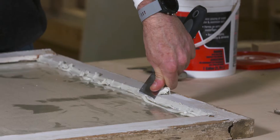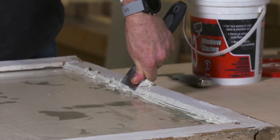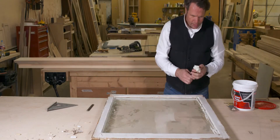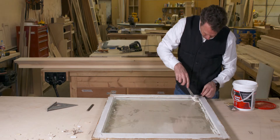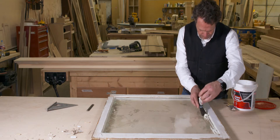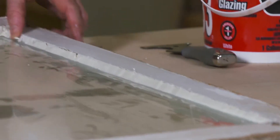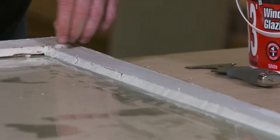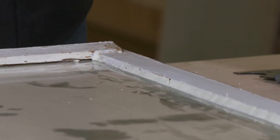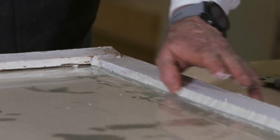I'm going to come in here at an even steady pressure, pitch the putty knife, and slowly draw it along the edge of the window. All that excess picks up very easily. Now I can come along with my finger wherever it's rough. Here's some old glazing that was actually still in good condition, so we're not going to dig that out because it could cause too much damage to the glass. It's not going to dry immediately, and I'm ready to put the window back in.